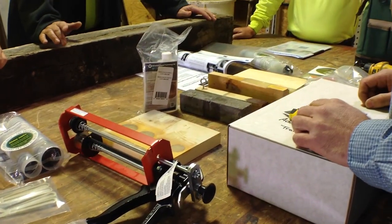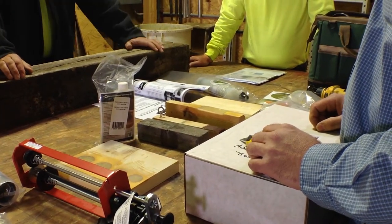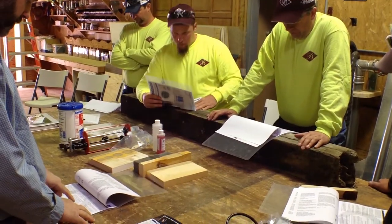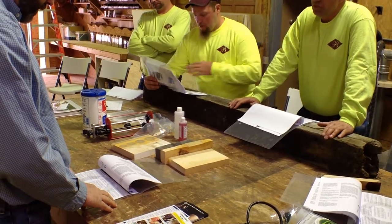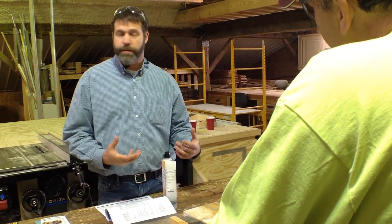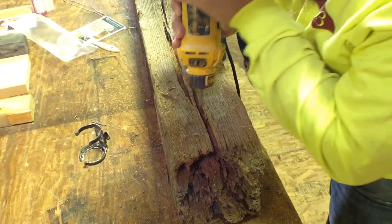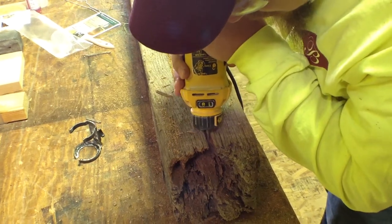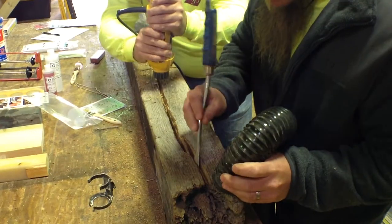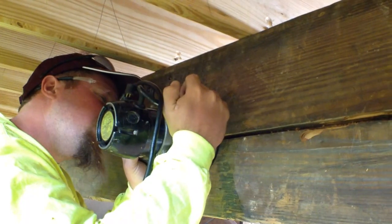The certification program began with an overview of ART's FlexTech HV Epoxy Repair System. With the technical aspects explained, the next part of the program involved a hands-on demonstration beginning with proper surface preparation. The importance of bringing the repair down to solid wood fibers and routing cracks out to at least a quarter of an inch was highlighted. Techniques using routers and other tools were shown.